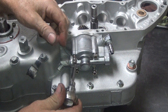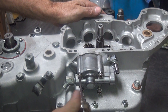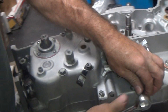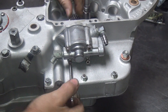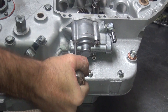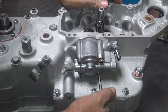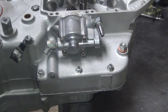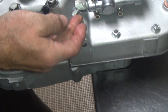Let it self-center a little bit. The pump still turns. Let me torque it down. Tight, tight, tight, tight, tight. Yeah, they said that brand new pump would cavitate. Well, they cavitate too. I never had any problems after that. We're pretty tight right here on our clearance.